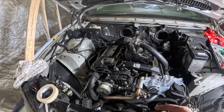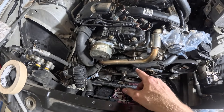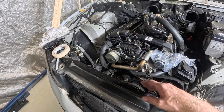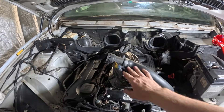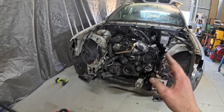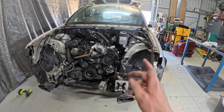So that didn't take too long. Hardest part was getting the radiator out with that fan. For anyone actually going to do that - loosen the nut that way, turn it that way, so it's reversed thread obviously. Got all that out and pulled out. That big scuttle thing was really hard to get off - I had to do that and get all the wiring out. It's all taped up and wrapped up in here, ECU's out of harm's way. We've got the front off - much easier to get it out this way. Exhaust, shifter and tail shaft are undone.